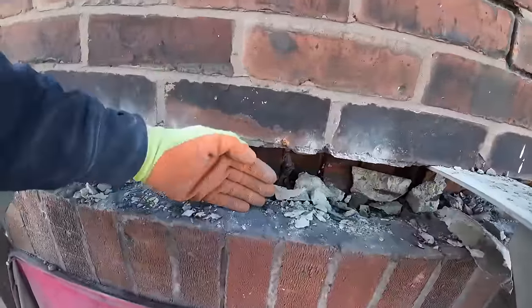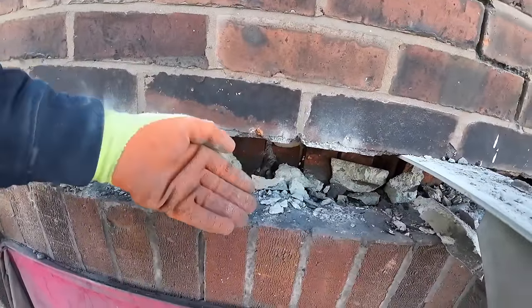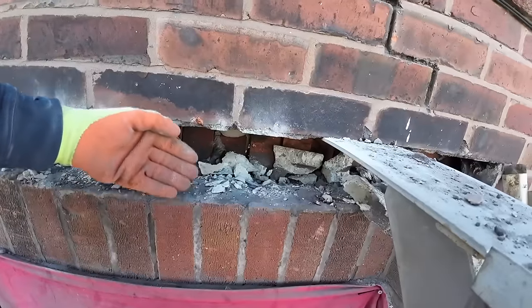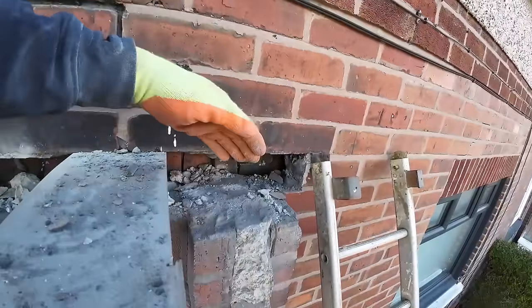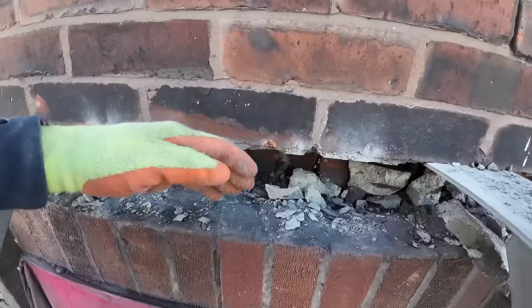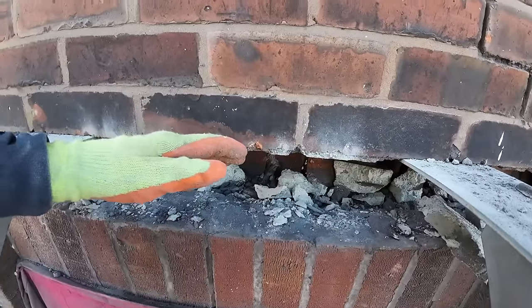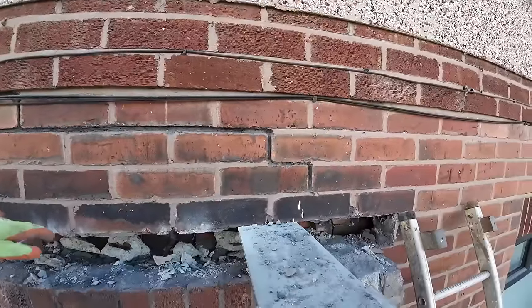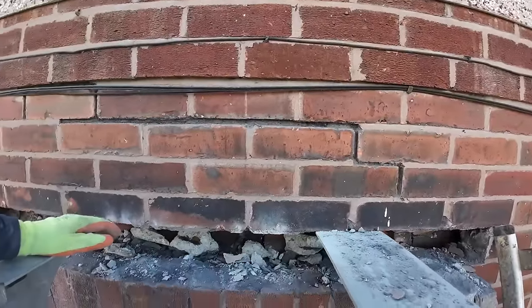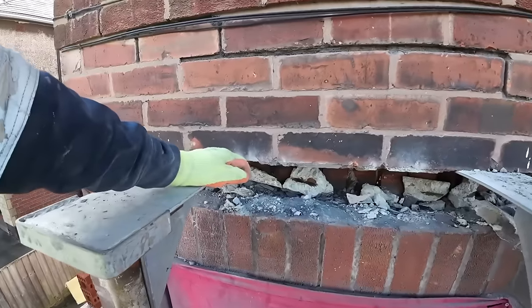As you can see, we've got a lip. So I spoke to the customer and we discussed it and I said we'll put a fillet on it for now, like a strong mix mortar to fillet it. Same for these pillars when we rebuild these back up. And it can probably have maybe dressed with lead or even left because it's having the canopy over the top, it's having the porch roof over the top. I think it's a timber porch, but it's an open porch, I think it's like a couple of legs and a timber roof on it, so that's the plan.